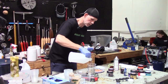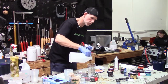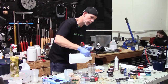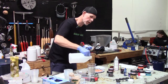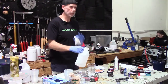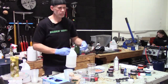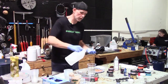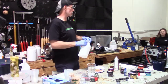Make sure — even the veterans out there who've been casting for a while — if you're buying a new resin you haven't used before, read the label. Because if you measure by volume in equal parts and it was meant to be measured by weight, you're probably going to run into problems. It's not going to cure right, and you're going to have a bad day and it's going to cost you a lot of money.